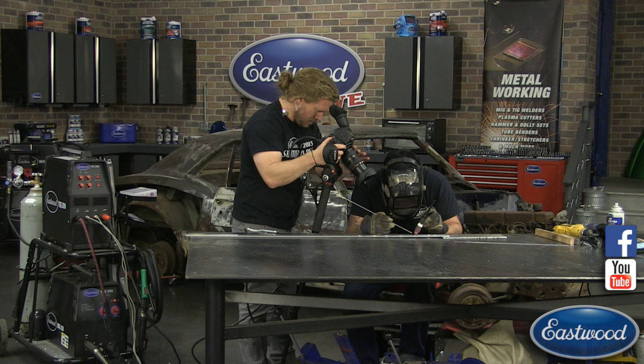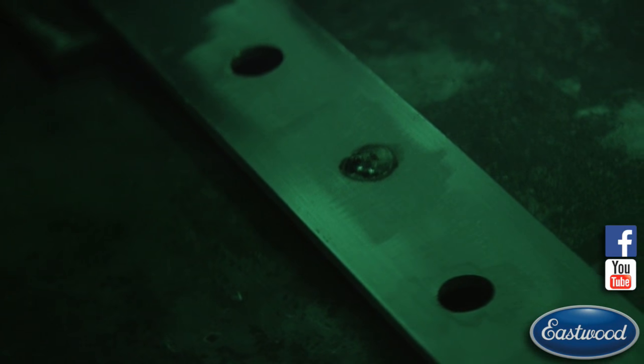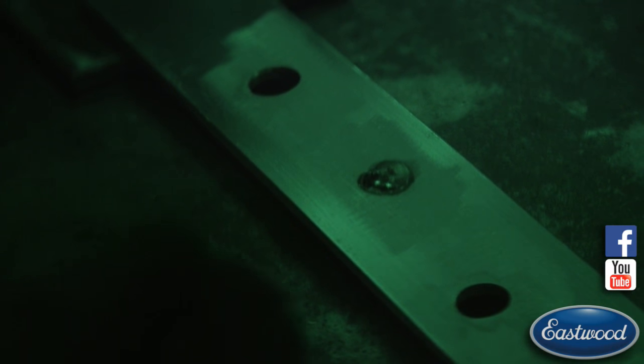So I added a lot of filler rod to that. We're going to show the backside as well. We'll show you the two sides after I'm done here, but this side, you can't see right now because we have the lens on. I basically filled that hole up all the way. When I punched that pedal, it caved in that extra weld that I was putting on the edges, and then I added filler rod to fill it all up in one shot, full amperage.